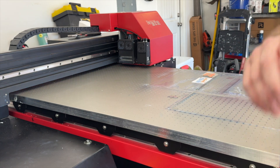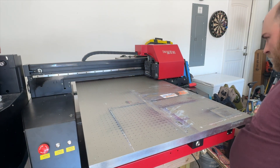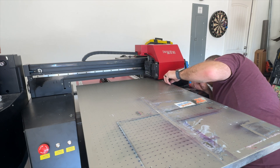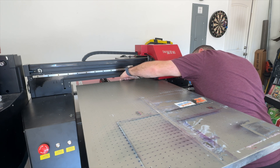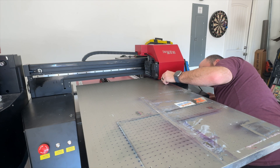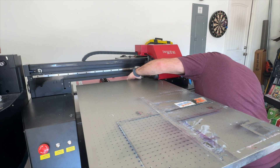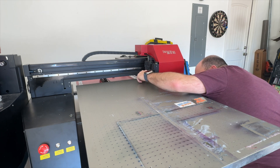Next, I'm going to take my little gauge and use it to see what I need to do to make the bed match the front. On this side, I'm going to lift it up, get it screwed into place while I hold it up, and then — just like the front — I can slide the gauge under. I lift it just a tiny bit more and get it tight in place, so the gauge slides right under, just like the other side.